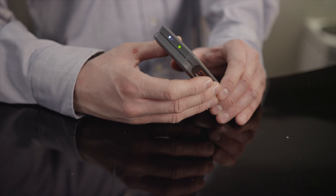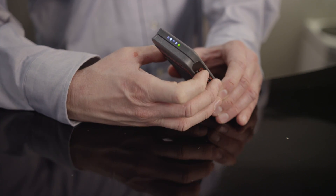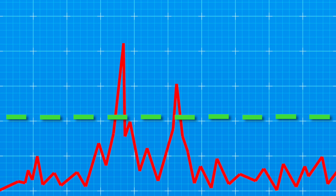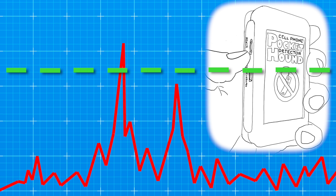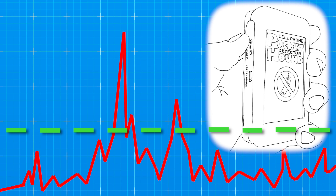There are 10 manual threshold levels. To be sure you know what level you are at, you need to zero the unit by toggling the wheel down 10 times. Then you can proceed to set the level from 1 to 10 by toggling the wheel up one increment at a time. Keep in mind that the unit will still detect RF as you are setting the threshold, so it may vibrate. The ideal setting will be slightly higher than the background RF level or noise floor. The higher the level you toggle up, the higher you are raising the threshold. Raising the threshold scans for stronger signals, while lowering the threshold scans for weaker or more distant signals. So if your Pocket Hound is constantly triggering, you should raise the threshold to ignore most of that RF noise and concentrate on the stronger cellular signals. And if your Pocket Hound is not alerting you when you are sure there is nearby activity, you should lower the threshold down to look for weaker signals.